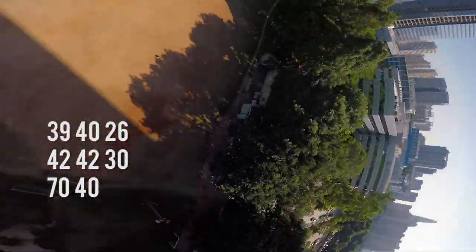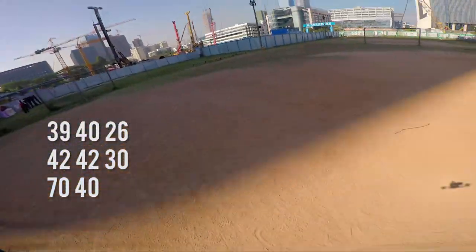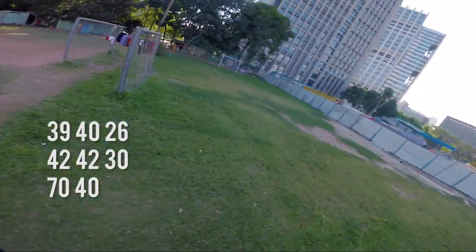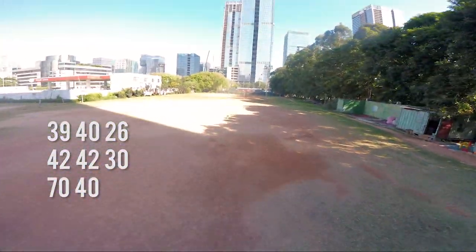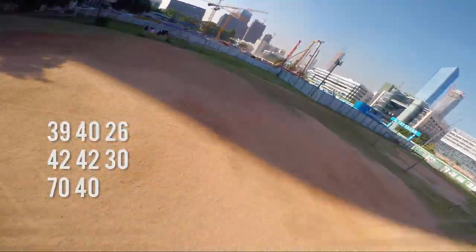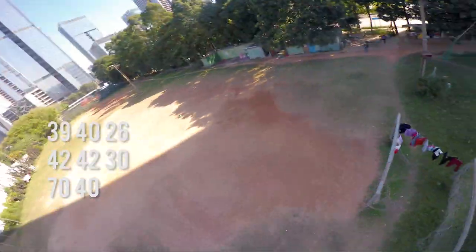The idea is you want the least amount of tuning possible for the quad to fly really well, because more tuning means more work for the processors — you're creating more heat and unnecessary push and pull. That's why you want to start with low D to figure out what's really going on with the P and I. At least that's my understanding from all the people online doing PID tutorials. For the Snail system, what I figured out is that the PIDs just have to come down a lot, and then you start tuning from there.